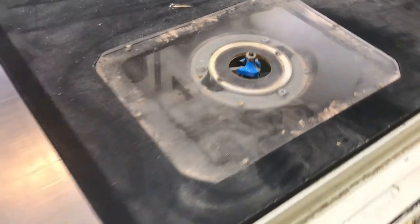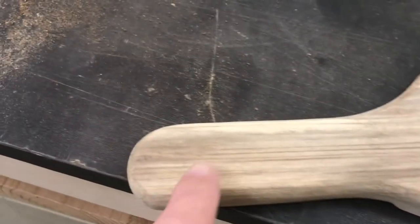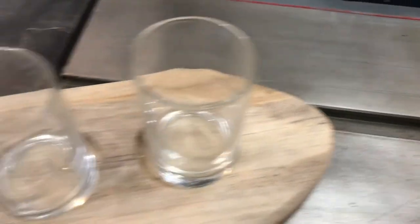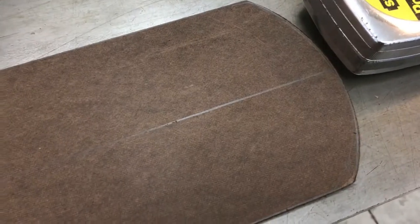We just made a few modifications - tapering off the handle a little bit at the end, just kind of making a swooping curve there instead of having just a rounded end, more of a fishtail kind of end. And then not having such a strong curve at this end, making it a lot more gradual. This end wasn't so bad but I think it's going to look a lot better the way we have it. We'll get this cut out with the jigsaw, then bring it to the sander to sneak up to the pencil lines and get it as exact as we can.